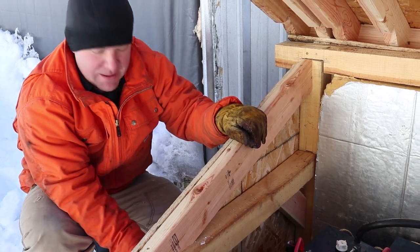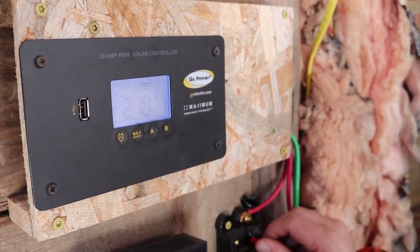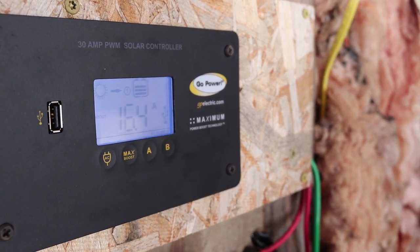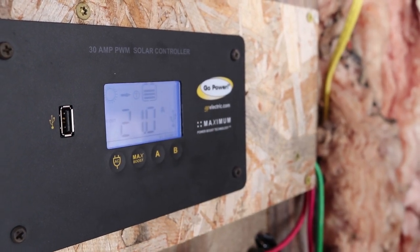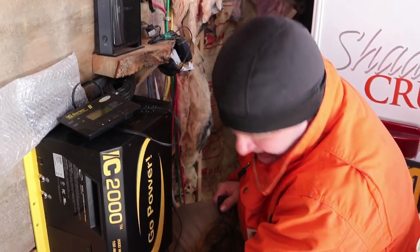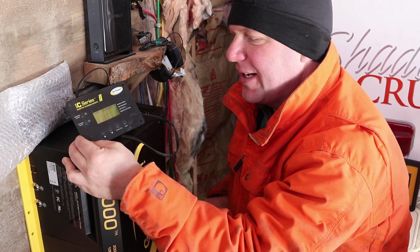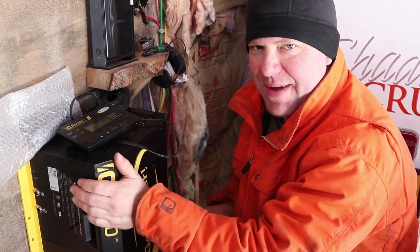Cable switcheroo is done. Battery bank is on — checking current and amps. This should drop to zero when the circuit is open. As soon as I close the circuit, if we're getting solar, you're going to see the current start to come back up. Always check this — don't just trust that the breaker is open. The inverter looks like it's getting some initialization, but it thinks the batteries are pretty dead. For today because of equalization, I'm going to turn off our entire grid — no load on those batteries at all. Starting at around 11.95 volts, we're going to run through an equalize.